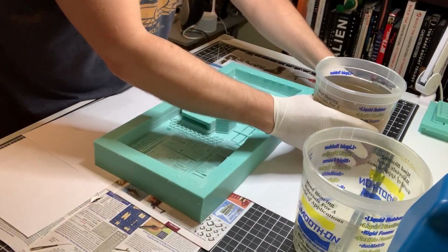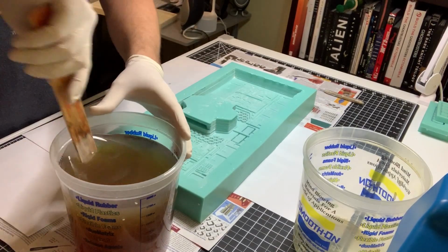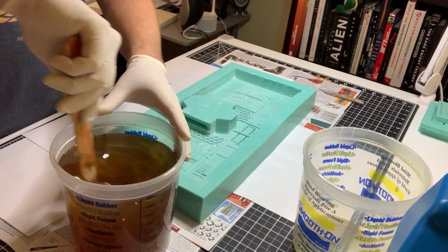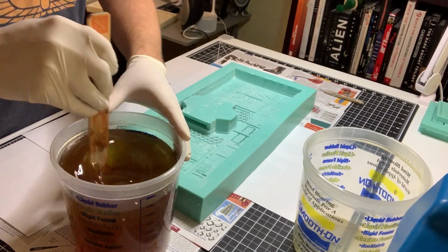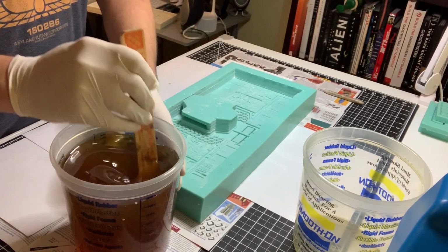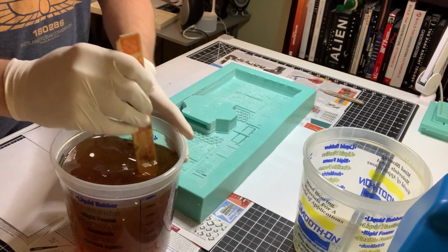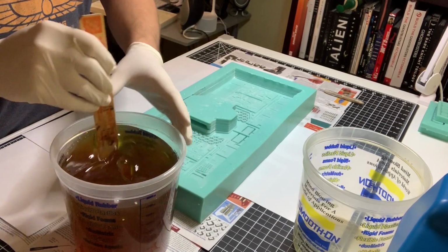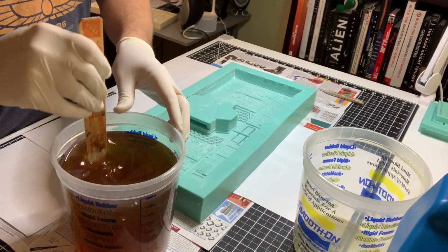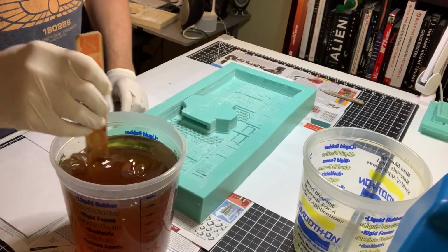Set to the side. Bring this over here and we're going to mix it real quick. Now, what I do is there is a certain amount of transparency that shows up when it's mixed well. And I wait, especially for deep pours like this, especially with lettering on the outside. I try to look for lettering about midway down. If I can see through it to where it's midway down, I know it's mixing well. If it stays cloudy, I worry about it.